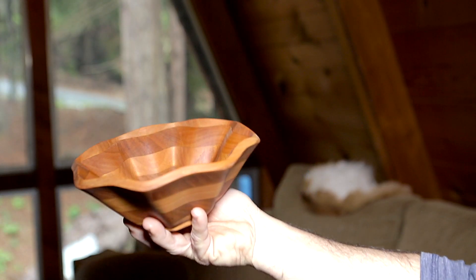What's up CNC woodworkers? I want to show you how to make this awesome wood bowl out of pieces of cherry wood using a CNC machine. First we're going to go into Fusion and figure out what size stock we need to mill up, then hop into my wood shop to start cutting and gluing wood, then go over to my Tormach PCNC machine and machine away. We'll start by machining the outside from the bottom downwards, then flip it over, reindex, and machine out the inside.